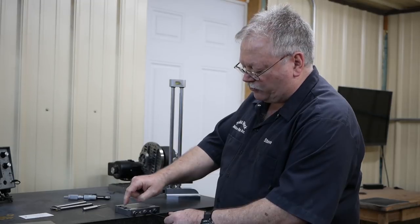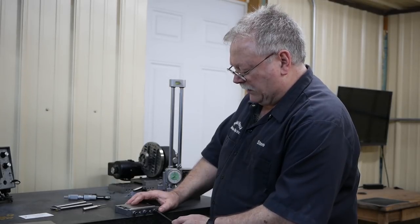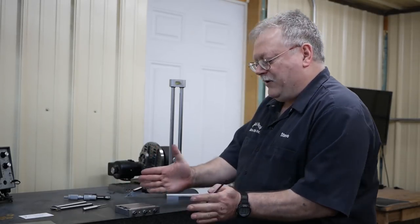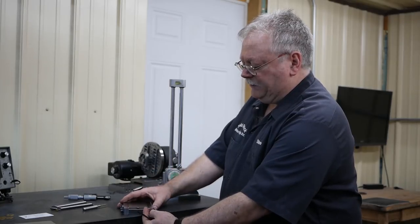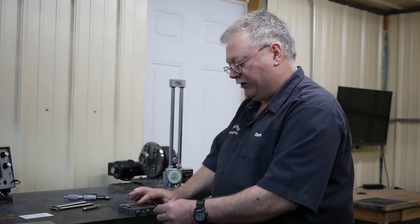This dowel over here is ground lower, but that will hold as the wheel's traveling across the part to keep it from shooting out there. I'll come up and snug these ones up, and I don't want to put a lot of pressure because I'm pinching it, and I don't want it to bow up this way. If I had the steel, and I wanted to make this taller and the hold downs to go down, it would have been a lot better design.